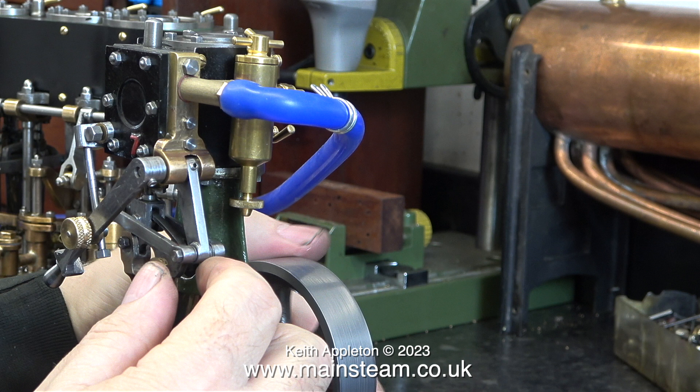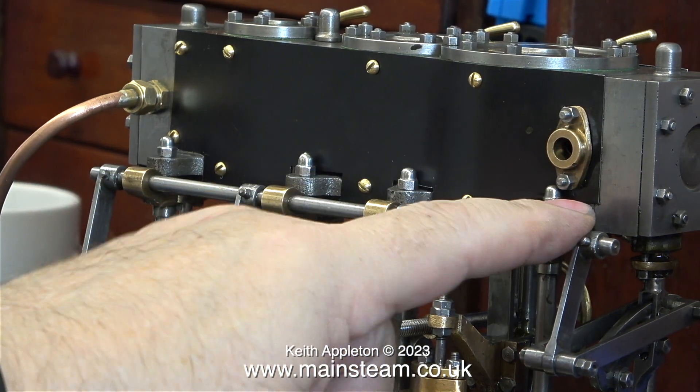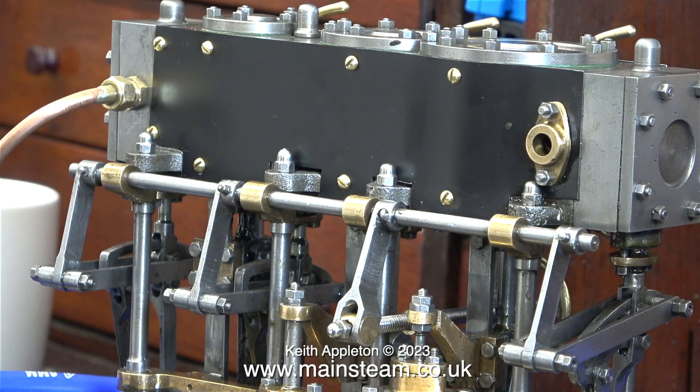He soon stopped crying anyway. I pointed out the problems in this area, and said that it was not a good idea to use grub screws to hold parts like this in place — not unless of course you file flats on the shaft, which is too short anyway. I personally prefer to use this method. Here's my triple expansion engine, and it's using taper pins, and one of them, which has a lot of stress on it, is bigger than the rest.